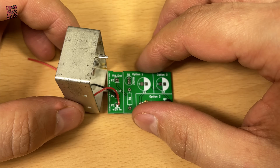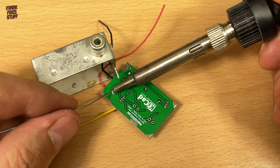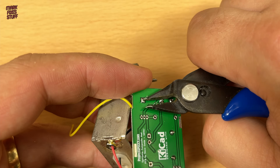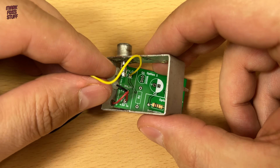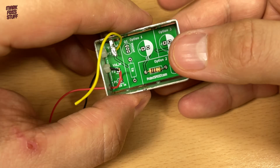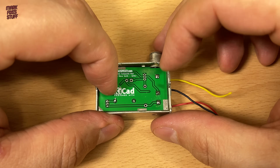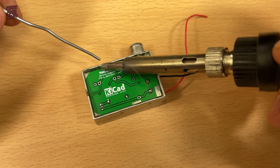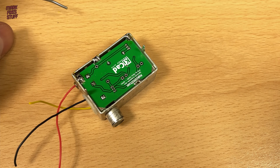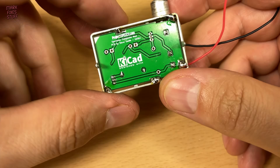Next, we need to put a wire from video out to the centre pin of the modulator. We'll use a yellow wire to do this. With the video wire soldered into the board, we can strip, cut and solder it precisely to the output pin. But first, it would be a good idea to fix the board into place so it can't move after the video wire is attached. This is just a case of blobbing some solder — easy with a massive tip, and you don't really need to do all of the points. Solid as a rock.